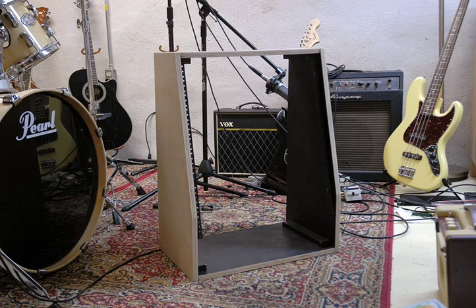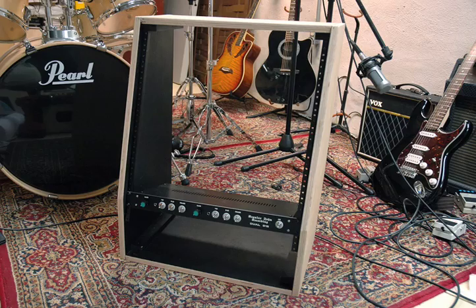So that's really all there is to it, other than putting in the actual gear. The rails that I bought didn't come with the small bolts to hold the equipment in either, so I had to get some from my local hardware store. Rack rails generally take 10-32 bolts, which are really cheap — some rails do have them included. By building a rack myself, I saved somewhere around $100, plus I got something that's exactly what I needed.